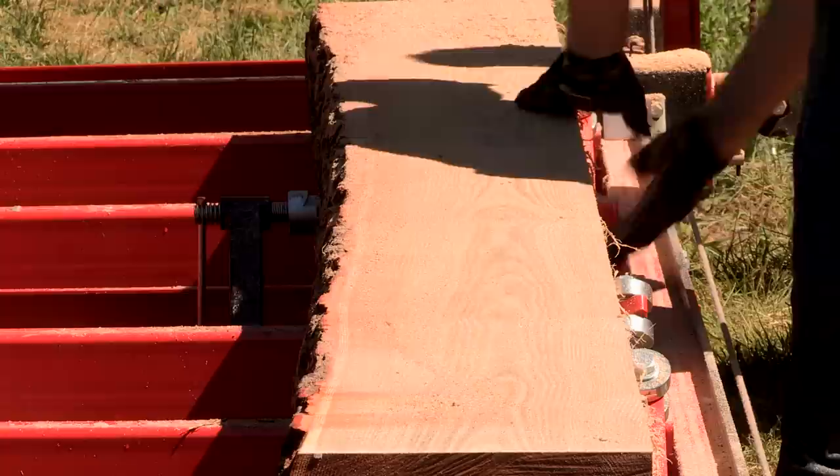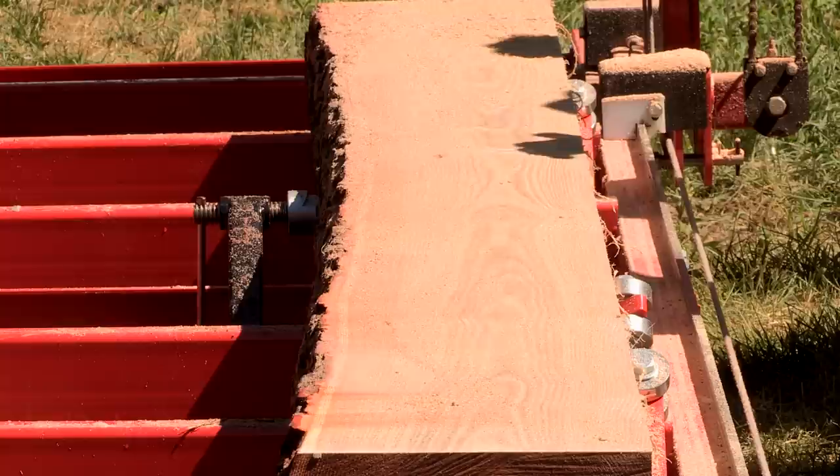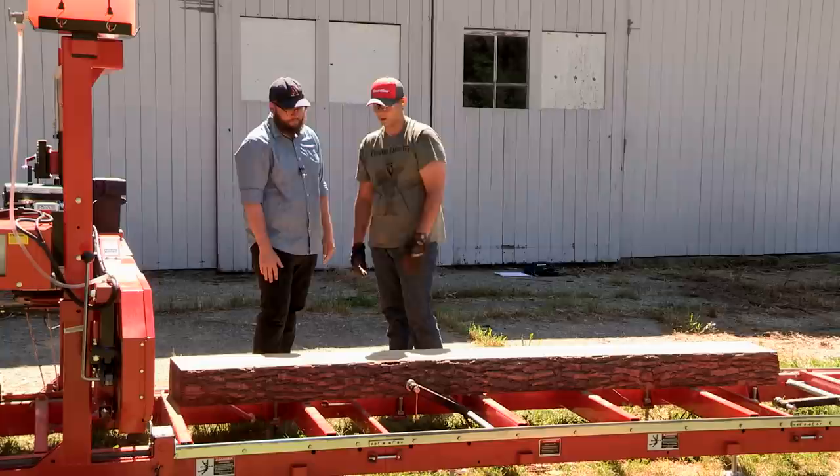Right now you're at about a 6.5-7 inch wide cant. Oh, sure, yeah. Thickness wise. Yeah. And so in order to make our top grade of lumber, we have to at least be 6 inches. So it's better to turn it now. You can still come back to this face, but see if we can't peel off a couple more boards before, like you said, you get into more of that defect that's below. Sure. So we're gonna turn it 90 one more time, and then we'll be set to roll.